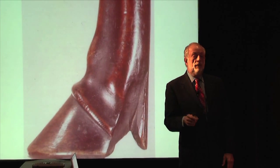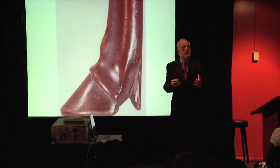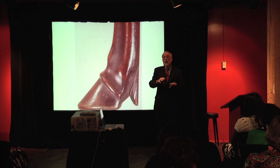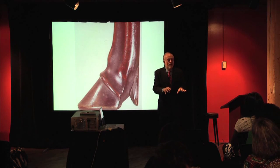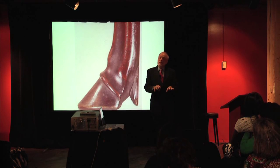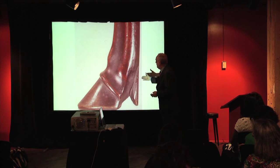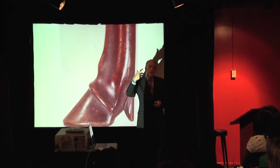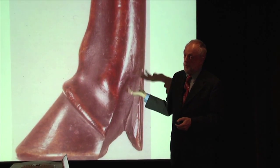All antiques, if they have not been refinished, have a beautiful aspect which dealers love to call patina. Patina is dirt, grease, and grime. It builds up in the recesses and with time a piece becomes more beautiful than it was the day it was made. It always makes me cringe when I hear somebody say, oh yeah, I restore antiques — it'll look just like the day it was made when I finish. In other words, it won't be anywhere near as beautiful as it is now. When you are working with an original finish that has a beautiful patina, you want to enhance that by gentle, delicate cleaning — not savage it and take it all away.